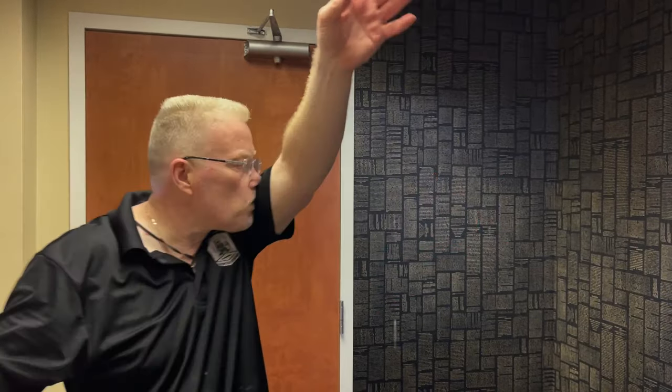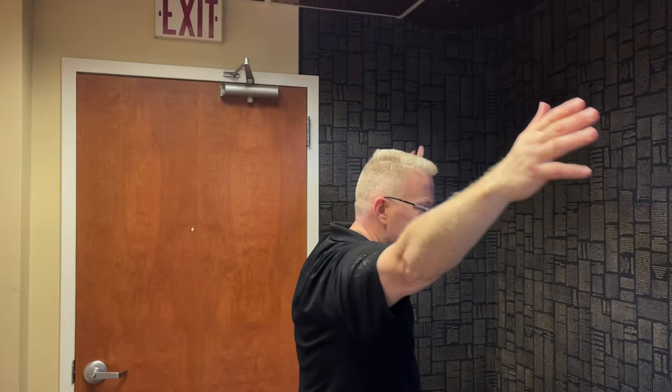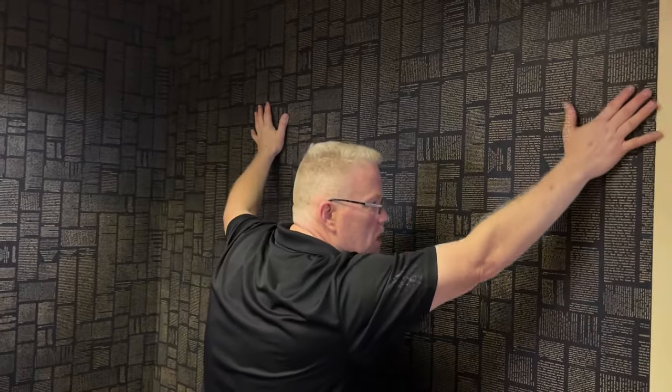With 54-inch goods, it's a little beyond the capacity of the human body to control 54-inch goods, especially for a small person. So let's face it, 48 would be ideal. But with 54, here's what happens. The tendency is for inches 48 to 54 to be 2 to 3 inches down, imperceptibly, from your left side where you have more control. Therefore, I highly suggest when you're hanging this wall covering that you get a bench ladder.